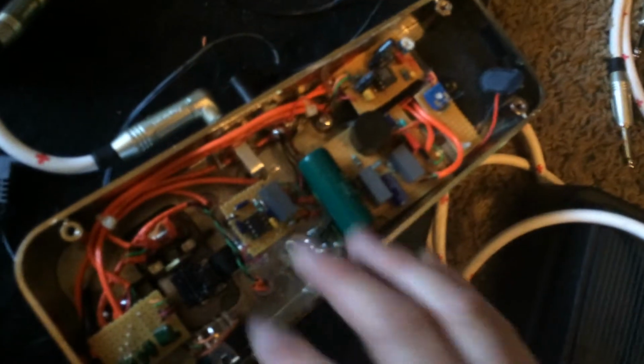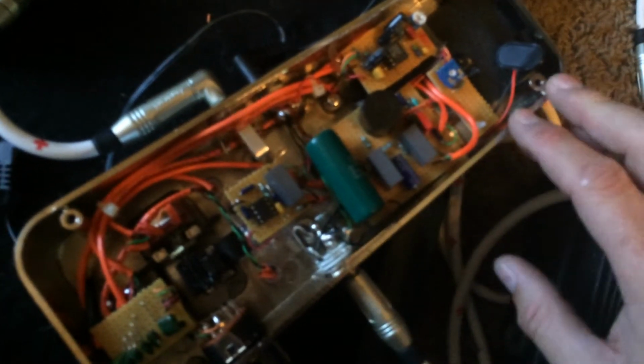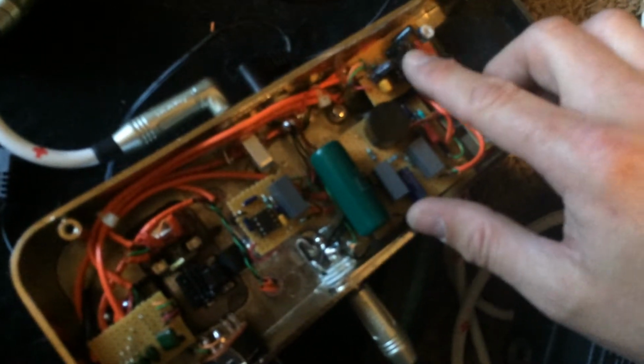Again, I based it around your early McCoy, so the 2 transistor, no input buffer. I bypassed it into the 535 style. And then the output's the Fox Rock style circuit. I modified it, did a different op amp, more to my taste. This does the mids, kind of like on the 535. You got those 2 little trimmers.